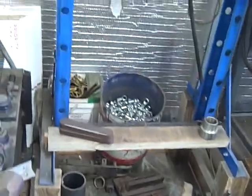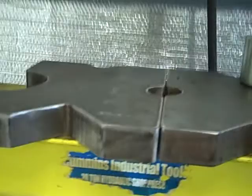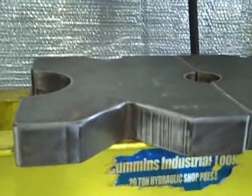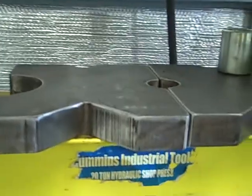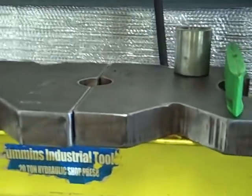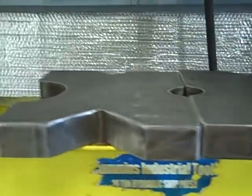I've made modifications to it that make it a little bit more friendly to use. Obviously, I raised it up a little bit — it was too short, so I brought things up higher. One of the biggest safety things I did was to get some of these large press plates from Swag Off-Road. They make a really good press plate that's steel and not the cheap cast pieces that could shatter under pressure and load. I do a lot of rebuilding of T5 transmissions and 3650s, always trying to press off gears and things of this nature.